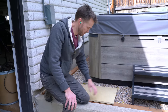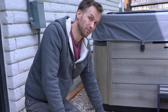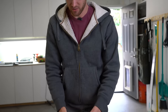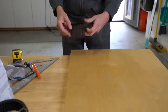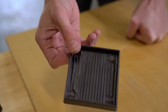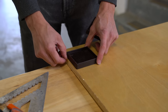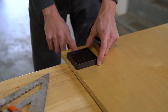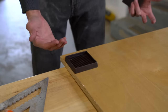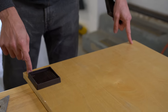Just some rubber feet that'll raise it up, but we'll support it more on the gravel side to get this whole board level. These are the rubber feet we're going to be attaching to the board and we're just going to screw these right into the bottom. It's designed to have a post, but we're actually probably going to be using them upside down. We're going to leave just the tiniest eighth-inch border on this side, and on this side we're going to leave about an inch so that as we build our frame we'll be able to screw into it right on the corner.